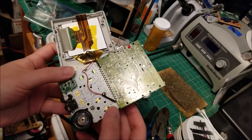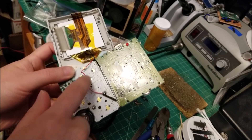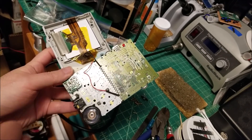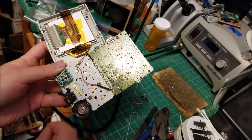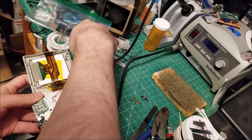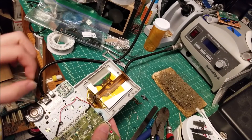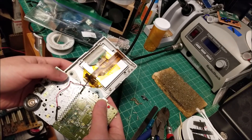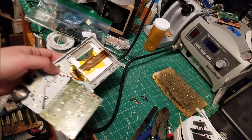Inside you can see there's a little resistor going to the plus 5 volts and ground, which is basically pulling 5 volts from the main regulator. What I'm going to do is desolder the positive and solder it to the positive of the new regulator. I'm going to do the 5V mod first and then the bivert, because the 5V mod needs access to the backlight wires on the front side of the board for now.